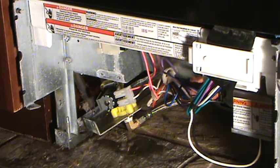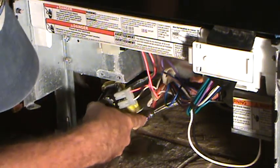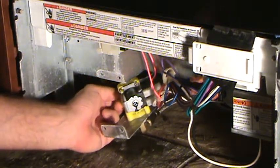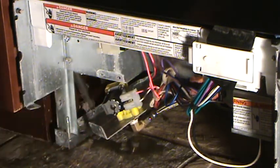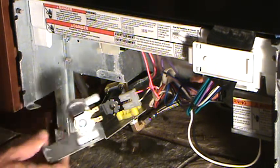Here's what I did. I know an appliance service tech, and I call the same guy out every time I need him — that works out really well. He dropped by, took a look, and said you know what, he had just ordered one of those parts. Generally it's not this part that leaks on a dishwasher — he usually fixes something else — but he had one and sold it to me. He told me what I needed to do: undo those wires, undo the water line, and there's a pipe in the back that connects with a little spring-loaded clamp. He sold me the part.